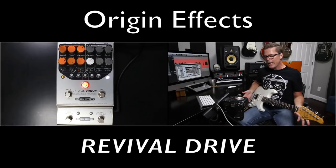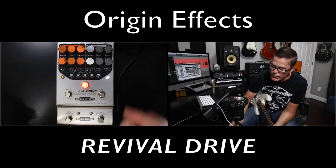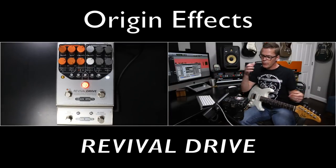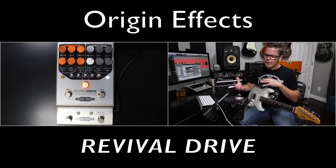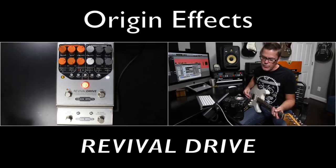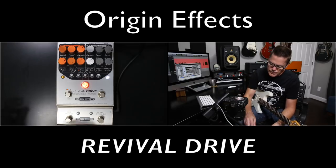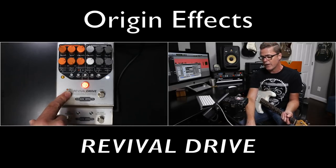Now on the silicon side, once again, it's going to be way quicker at converting voltage, so it's not so much a big sonic difference between silicon rectified and tube rectified as much as it is a feel difference. Just how quickly it reacts to the changes in voltage is really what you're getting between the two channels. With that in mind, I'll stay on my Marshall IR and let's bump over to the valve rectified side.